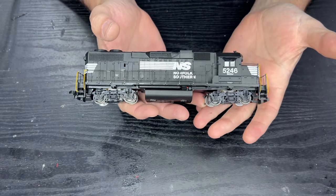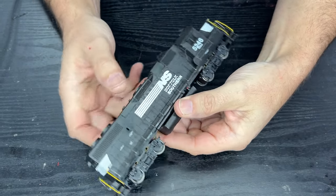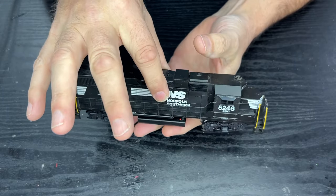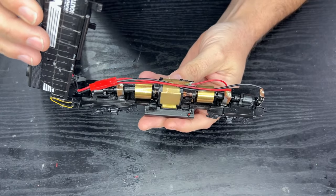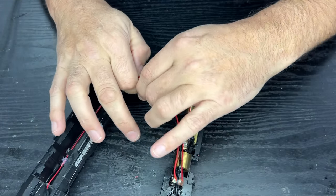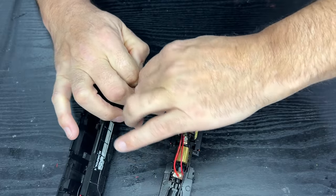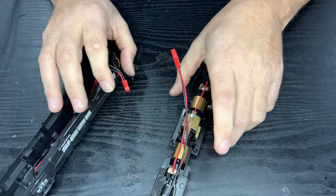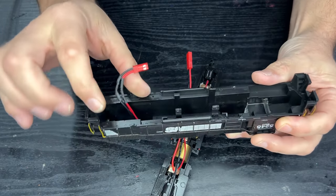If you keep these in DC format they're actually really easy to work on. They also have really easy removable shells, however over time they get really loose, so for the older blue boxes don't be lifting them up by this section here because they could just fall off and your loco falls on the floor. I've already been in here and installed some LEDs - this was before I even considered the whole DCC thing - and as you can see these wires are way too chunky, so I'll probably chop the wires down and get rid of all this bulk.